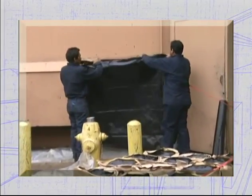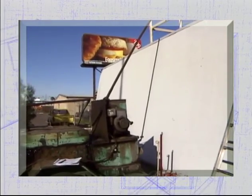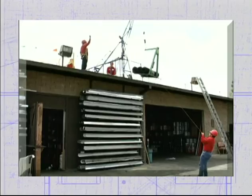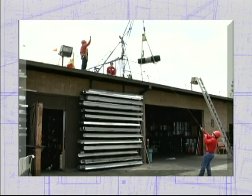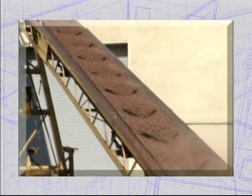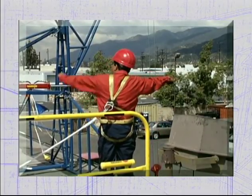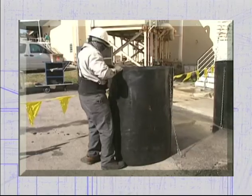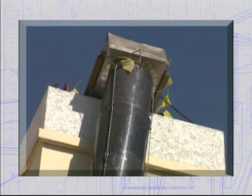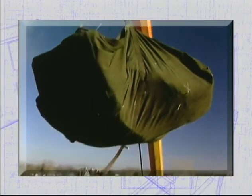Ground setup includes protecting the buildings, landscaping, and general public, as well as the setup of kettles, tankers, and their supply lines. And don't forget your hard hat. We've seen how to organize equipment and materials, and that getting them to the roof requires setting up hoists and conveyors. Remember that setting up all fall protection equipment must be the first task once you're up on the roof. And finally, what you need to set up for removal of roofing trash and debris, including disposal chutes, slides, or hoisting it away in steel tubs or heavy-duty tarps.